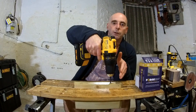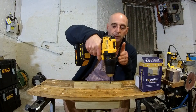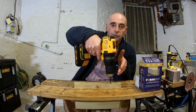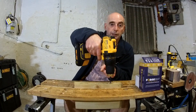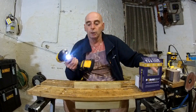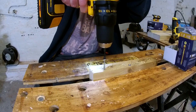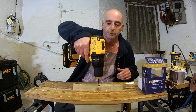This is how I found out we have to set the torque settings up. So we'll move it up — tried four, five, six, seven, eight — going up to eight didn't do it. Tried ten — and there we go, it came undone. I'll bring the camera in to show you on the next one. If your screw has been in there for a long time, you could have actually damaged the head and you won't get it out — you might snap the bit. Using the clutch system is like a mini impact sort of idea, how it slips over the top.